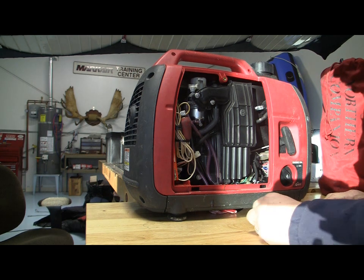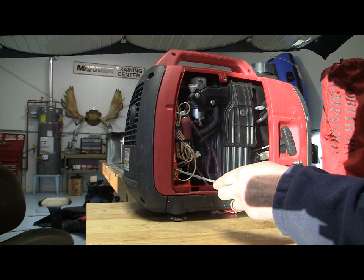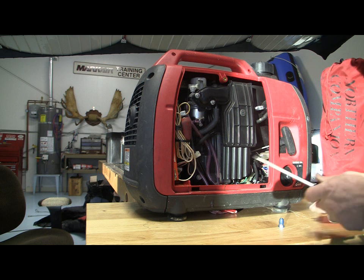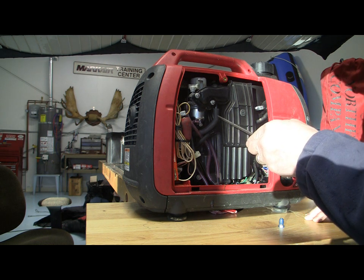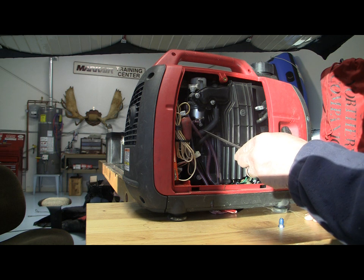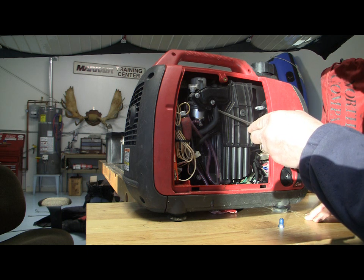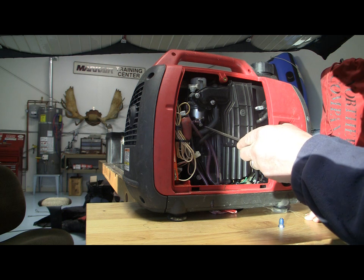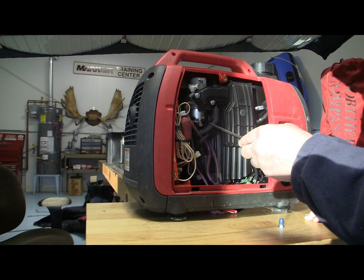Here's a good look at the inside of the Honda engine. You can see I've got an extra spark plug, my DC power cable kept inside the cover, and here's the engine breather. This is the other problem with these Hondas operating in sub-zero temperatures — the moisture from the crankcase gets pulled into the intake system. It pulls the crankcase fumes and moisture, which extends engine life and burns them through combustion in an environmentally friendly way.